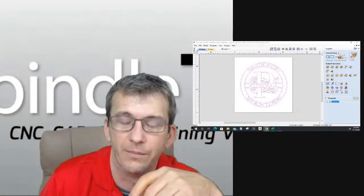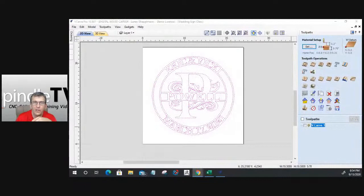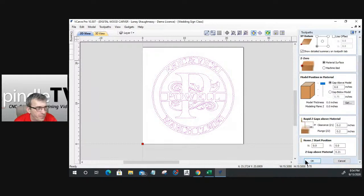I could get some good contrast and stuff out of it. But this is going to be kind of a cutout. So what I'm going to do here is go in my material setup and change this to a quarter of an inch, because that's what that sign is going to get cut out of.